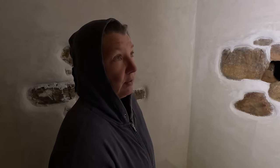It's still like invisible paint. The other thing that the video said was you really need to spray down. It's very cold here at the moment — it's winter, I think it's seven to ten degrees inside. It's not going to dry too fast, so we're not going to have any issues. The walls were just recently plastered, so they're not going to suck in too much moisture. And it also gives us more working time, so now I can go back over it. The other thing we could do is go over it either with a trowel or with a brush after it's semi-dried to burnish it — smooth it out so that we don't get any brush marks.